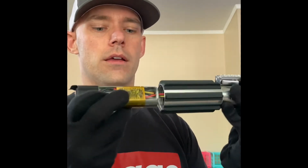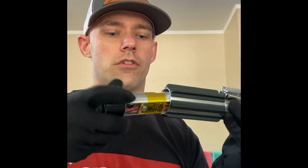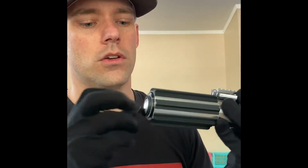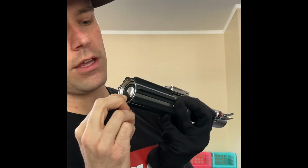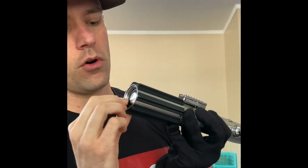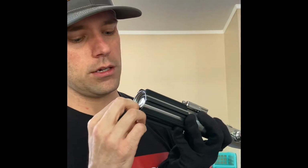But yeah, so there's the wires inside of there. I don't know if you guys can see, but you just kind of twist this chassis up a bit before you stick it in, and that coils those wires up on the inside so that they fit nice and snug. So you're just going to push, not the speaker directly, but the edges. I'm going to use just my fingers. Push it in about a half inch, and then you'll notice it kind of doesn't want to go anymore. That's because that tape I wrap around there is up against these rubber grips on the inside, so it's a nice, snug, sturdy fit, and that chassis ain't moving. But you got to push it in just a little bit so that the pommel cap can go back on.